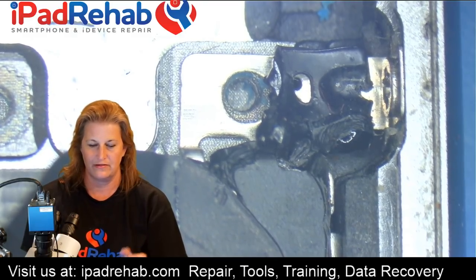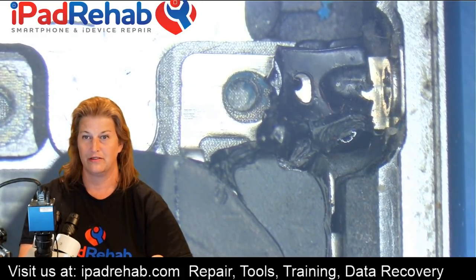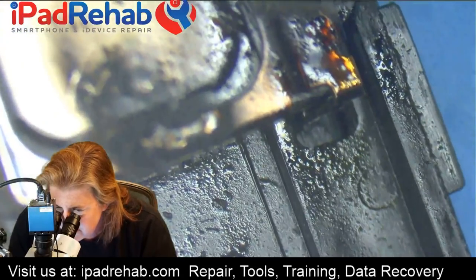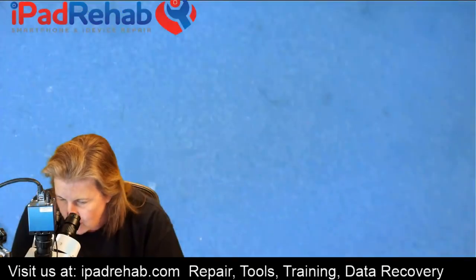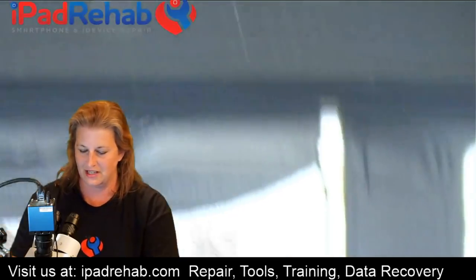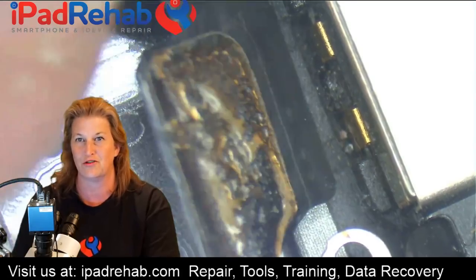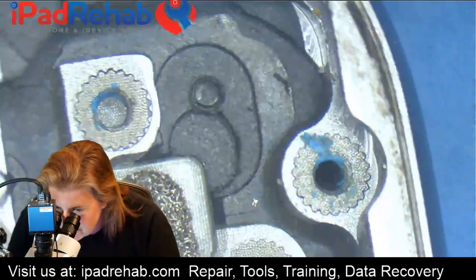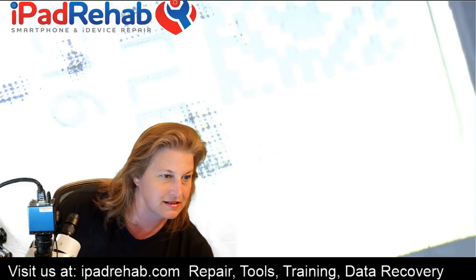Other plastics look entirely unaffected. The antenna stuff under this piece of tape looks entirely unaffected. So there you go — this is what microwave damage looks like. Be suspicious if you have a phone with multiple short circuits that hasn't had water damage. Comparing our experimental 5C — camera extremely damaged but the flexes totally fine — the iPhone 6 seems like a match with the same kind of fired adhesive and boiled plastic, and then totally fine right next door.